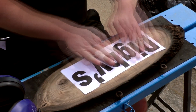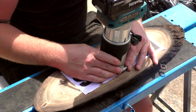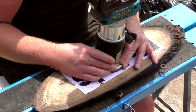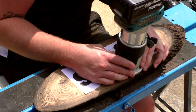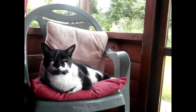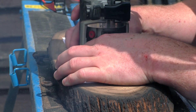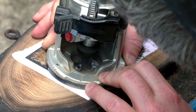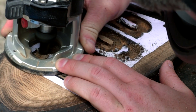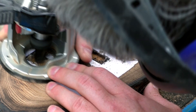For the summer house sign I used an ordinary straight router bit instead of the V-groove, because these letters were thicker so I couldn't just do them in one pass. I couldn't use a speed square on this sign either as there was no straight edge to reference off, so I just did it all freehand. By the way, Digby is the name of my mum and dad's cat who spends a lot of time in the summer house. The original name on the sign was Jessica and it was like that when they moved into the house — maybe Jessica was a cat too, who knows?